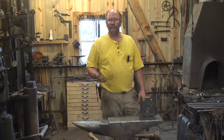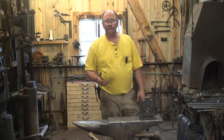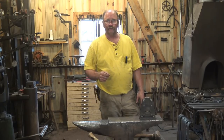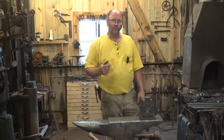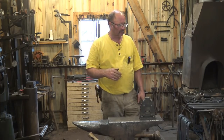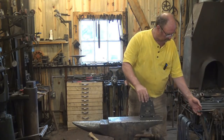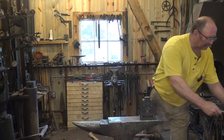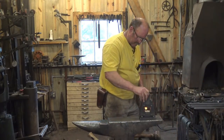So we're going to head over to the anvil, light the forge and let's make a nut and a bolt. As I mentioned, a bolt is really nothing more than a tenon on a very short bar that is actually the head. So we're going to do that with a piece of three-quarter inch square bar. I've already got it in the fire so we're going to bring it out and use the guillotine tool to create our tenon. I'm going to go for a three-eighths bolt in this case.